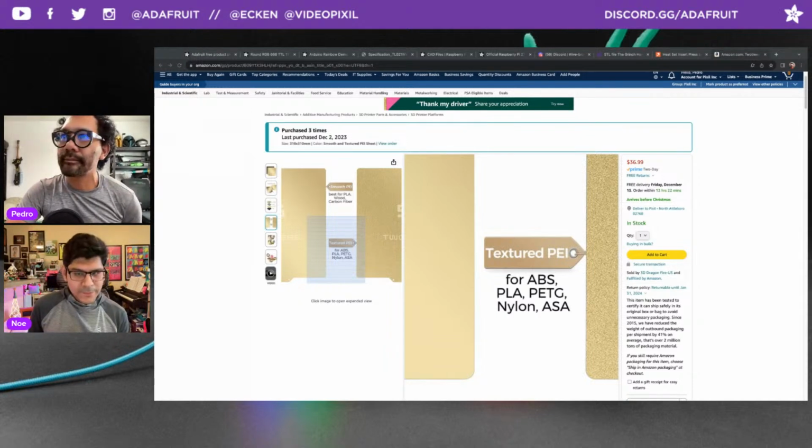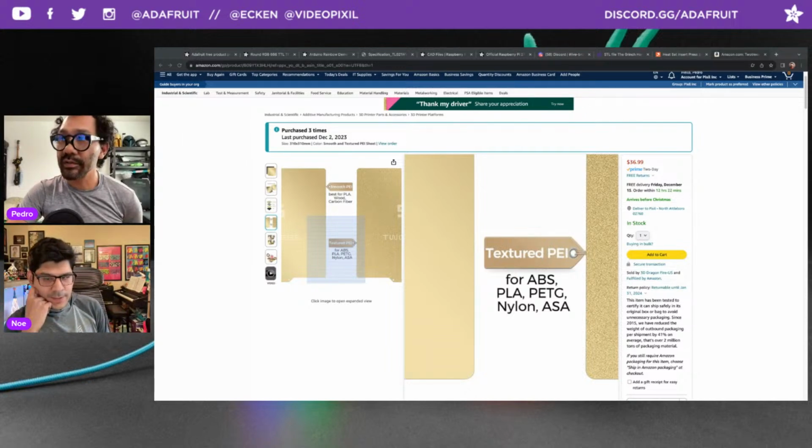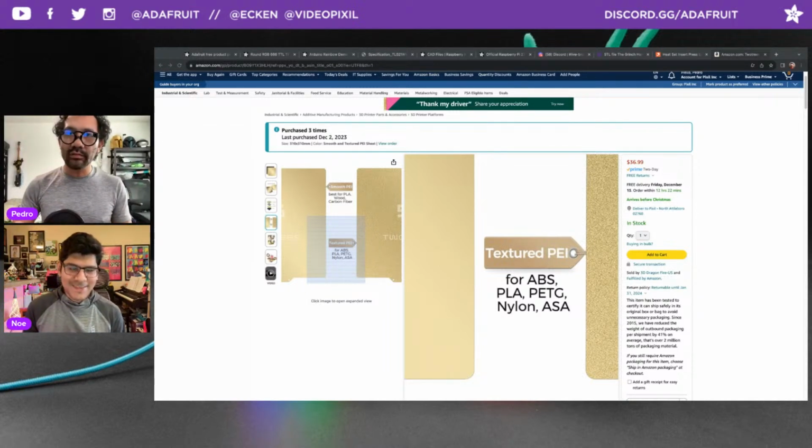Yep, and I think for TPU, of course TPU just tends to stick a little bit better than PLA, but it works fine on both sides. I tend to leave the bed a little hot, and then I remove it. That tends to be a good tip. It has to be like 50 C, you must remove the TPU without it permanently bonding to it.